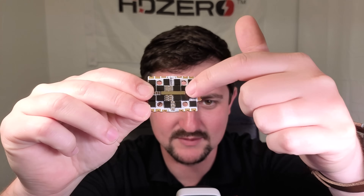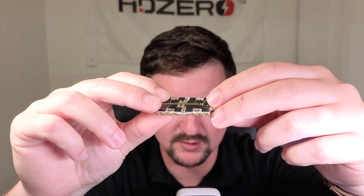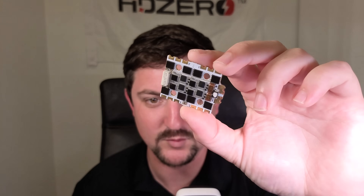We have a copper bar on the ESC which improves current delivery and heat dissipation. Doing all this has enabled us to sustain 70 amps on each motor for over 30 seconds, and 100 amps for 3 seconds per motor. The design provides extremely clean power to the microcontrollers for the ESCs, which prevents things like brownouts, burnt motors, and lockups that happen when you have a voltage spike from a hard crash. We've also applied a significant amount of conformal coating — you can see it in the shine — to help prevent moisture and corrosion from impacting performance.